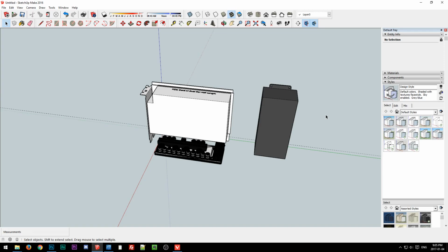Oh yeah, so Troy, as far as the Nano goes, the problem with the Nano is it's very spiky. Most modern video cards are spiky because that's how they do power management. They average much lower than previous generations. At least this was more the case with the 900 versus the 700 series, for instance. The 1000 series is on a new process node, so they do get more power efficiency off of that. But the 900 was much more power efficient than the 700 series, even though it was built at the same process node.